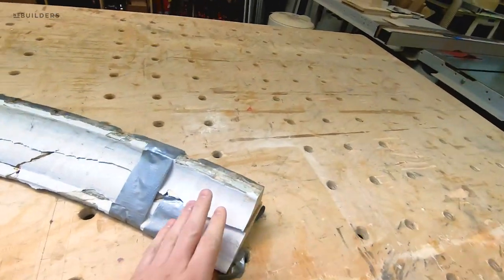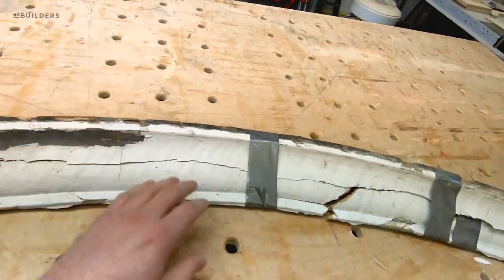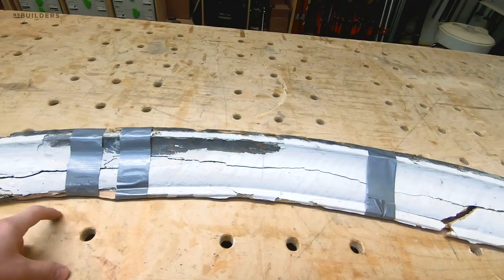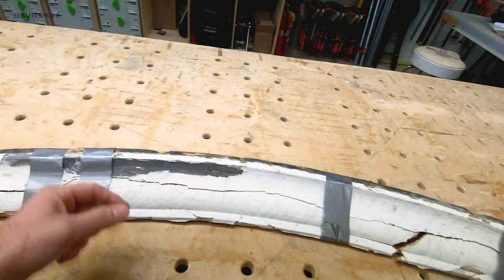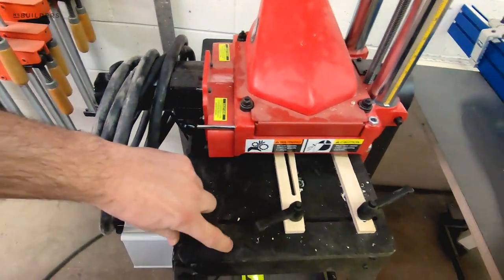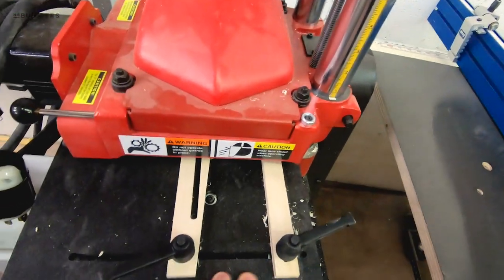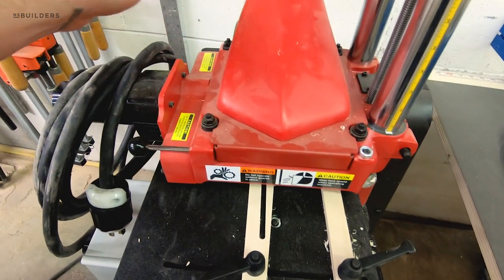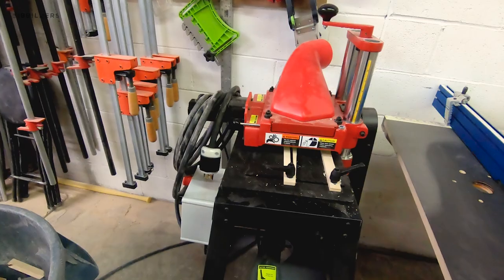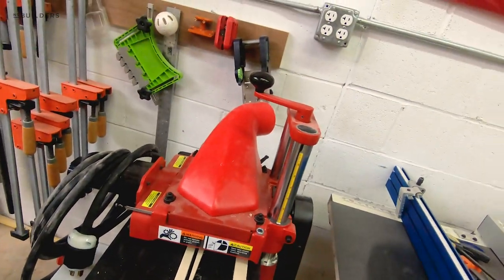To give you a little bit more about what we're gonna do for this curved molding — we're gonna make two templates. We'll have our inner radius and our outer radius, and what we're gonna do is make one template that runs on the inside and one for the exterior. Then we'll pull out our molder and actually fasten those templates down — the inside one here, the outside one here — going all the way across and through so that it will give us a guide. They would just be curved so that as our piece is going through, it will turn with that radius and we'll get a nice clean cut with our molder knives. Now I know this machine might look small, but it is quite powerful and will give us that shape that we're looking for, nice and clean.